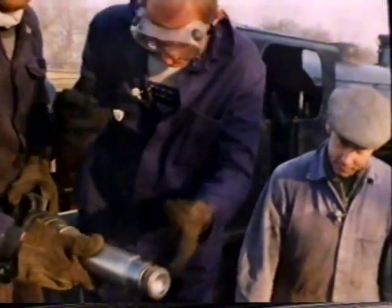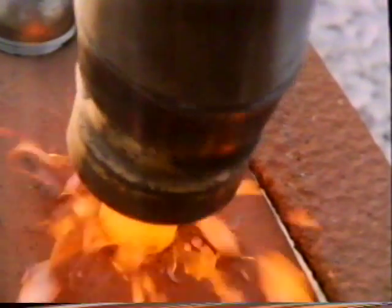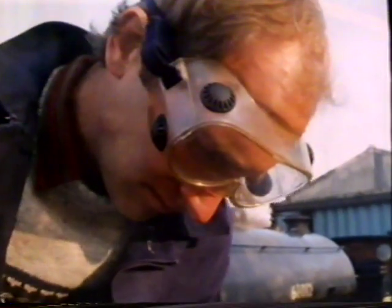There's the riveting hammer. Don't put your finger on the trigger. I had to grip the powerful gun tightly and press down extremely hard to flatten the hot rivet at both ends. You only get one crack at this job because once the rivet cools it's fixed, so Bob kept a close eye on what I was doing.